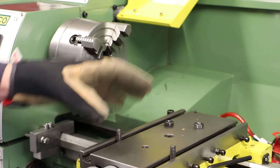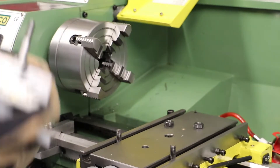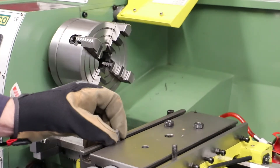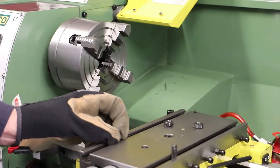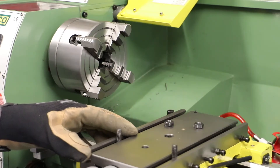So there are two suggested fixes looking online. One is to replace the bottom plate from a two-bolt design to a four-bolt design, giving increased rigidity and removing that straight line in line with the axis of the lathe. The other option is a fixed tool post. What I'm going to do is pursue the fixed tool post, as I've got some metal to do that with, and this series of videos will document that build.